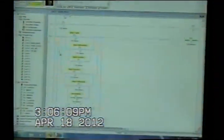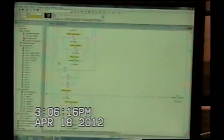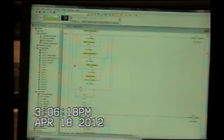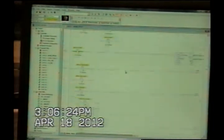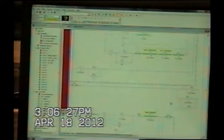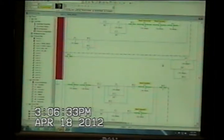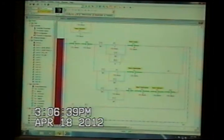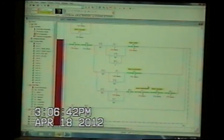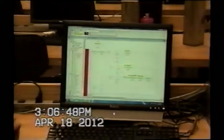Over here we've got the program — it's about 30 to 40 rungs. We have timers programmed for the 7-segment LEDs so they cut on and stay on until we want to shut off. Down here are the forward and reverse rungs — they've got all the push buttons and call buttons on the side of the elevator, the up and down LEDs, and the up and down motor contacts and outputs. They had to be organized in a way to lock them out so that when it was going to a floor, you couldn't press any other button and change the direction of the motor.